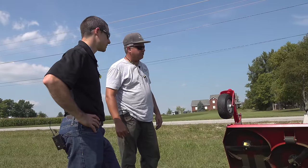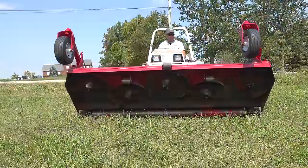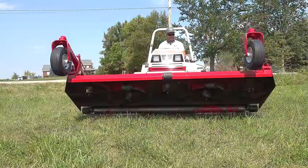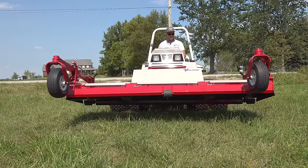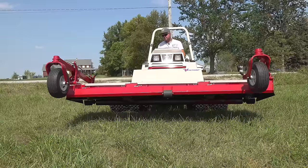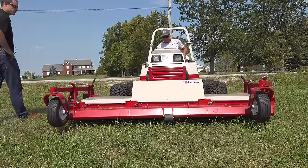Yeah, well, we have plenty of moisture here. Yeah. Especially in the spring. And when you drop it back down, there will be a lag of probably 3 or 4 seconds from when you hit full extension to when the cylinder really needs to be. So the cylinder needs to over-travel till I hit a stop. Yeah, till you hit the cylinder stop.